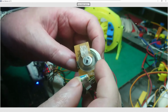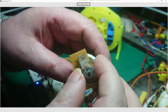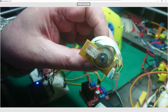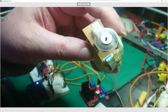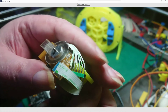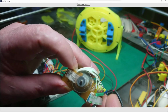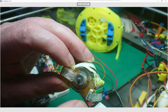It was really cheap. But basically, it has 335 or 353 or something lines on it, which I found out was a bit way over the top. Really, I could only spin the motor by applying 8 volts on it. If I put more than 8 volts on the motor, then the encoder couldn't keep up with the pulses, the ticks from the encoder.